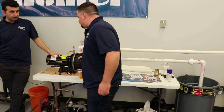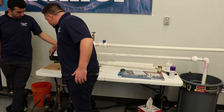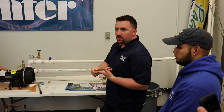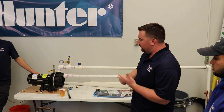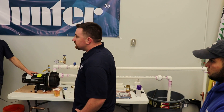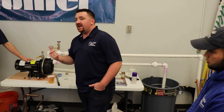Today we're going to talk about priming a pump, but first we'll go over the basics. Here's the pump - there's a spot in the back, the shell comes off. Back here there are two terminals: a white and a black wire and a green ground. White is your neutral, black is your hot wire, green is your ground - unless it's 220. If it's 220 it's just a hot and a hot, black and black, there is no neutral. Most of the time pumps come 220 unless it's one of these smaller ones. This one was pre-wired for 220 but there's a switch inside that you pull over to make it 110. Sometimes there's an adapter you turn around to revert it to 110.